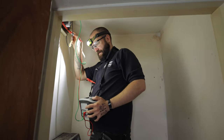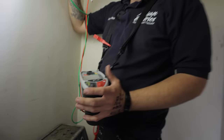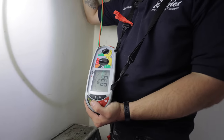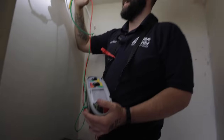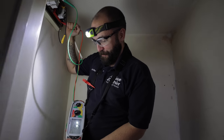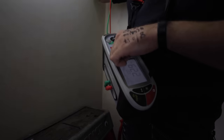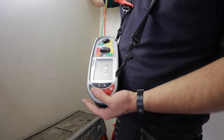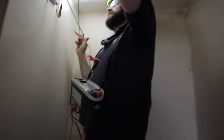I'm doing a global IR test now. At 250 volts it goes clear but at 500 it doesn't, because there's something sensitive plugged in - you can see it going up to about 22 when you put it on 500 it goes down. All of a sudden there's something sensitive plugged in.